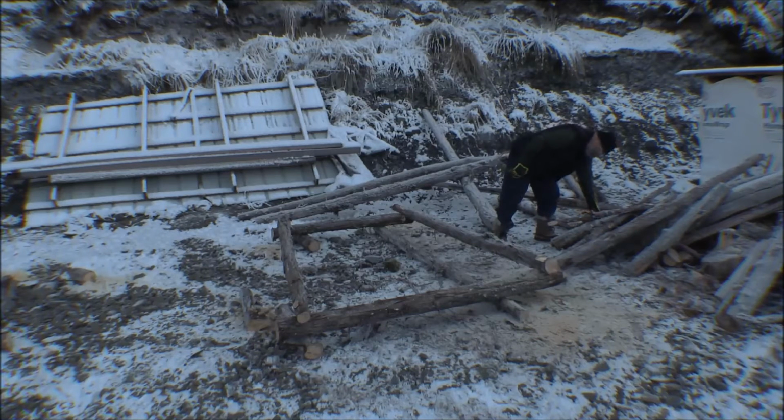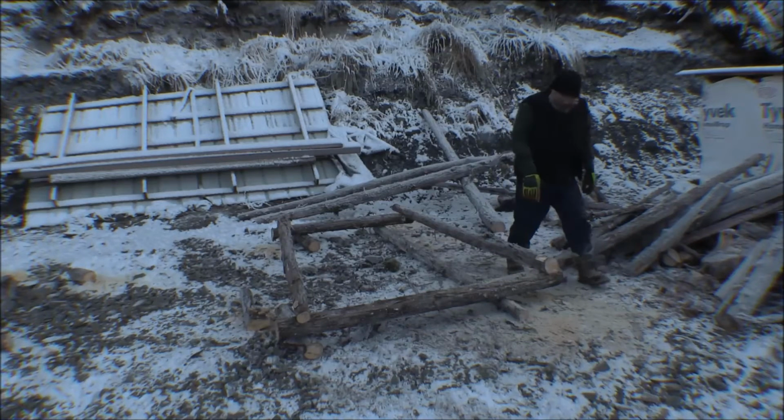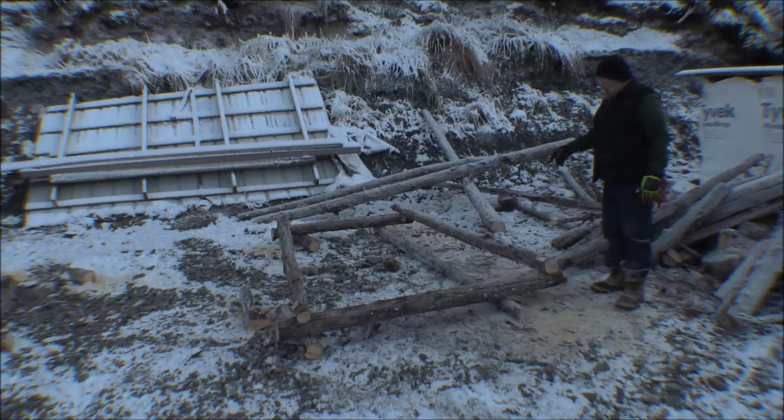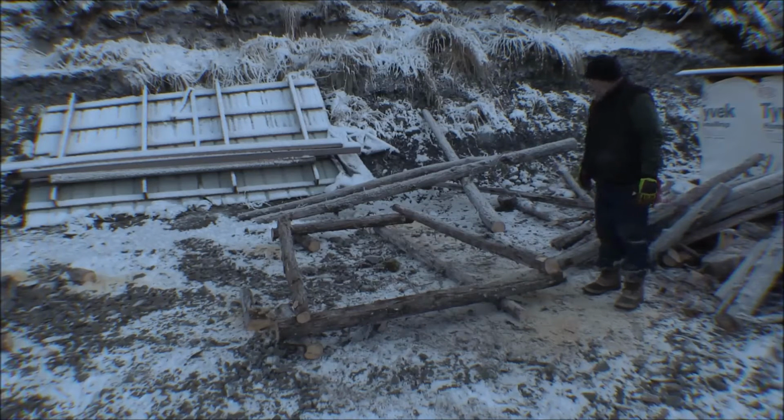Little bit of material off of both sides of that, so I got a flat spot. I scrub more off of the butt end of this one, the big end of this one, so I don't have to drive screws through so much material. And I'll go ahead and get a couple timber lock screws and drive in one in each one of those. I'm going to only put one in each one of those now because I want to be able to adjust it for square, for racking. If I put those in there tight, then they won't move. It'll be harder to get them to move to adjust them for racking.